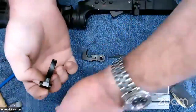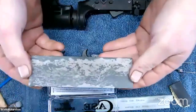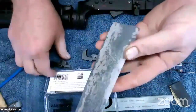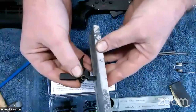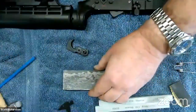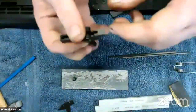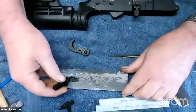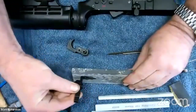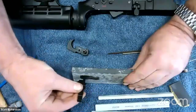I'm going to start with the sear. I use an Arkansas stone for most of this — it's a super fine stone from Arkansas, and I put a little bit of oil on there. What I'm going to do is move it back and forth, holding this sear face to the stone while maintaining that angle the entire time. You don't take a lot of pressure — you let the stone do the work. I'm using regular gun oil; any super-lightweight oil works.